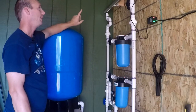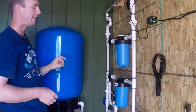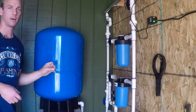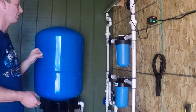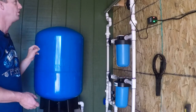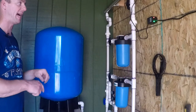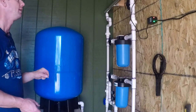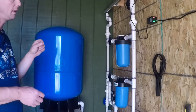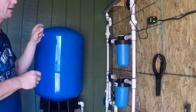There's a quartz sleeve between the water and the bulb that the light slides into. That quartz sleeve can become dirty. They recommend cleaning it once per year — this would depend on your water, so you'd need to be monitoring it. But I suspect with a good pre-filter, once a year would be fine. That quartz tube is removed, cleaned, and reinstalled using a microfiber towel or something that won't scratch it. The reason you clean it is because if dirt particles build up on the outside, bacteria could potentially hide behind them and not be neutralized.